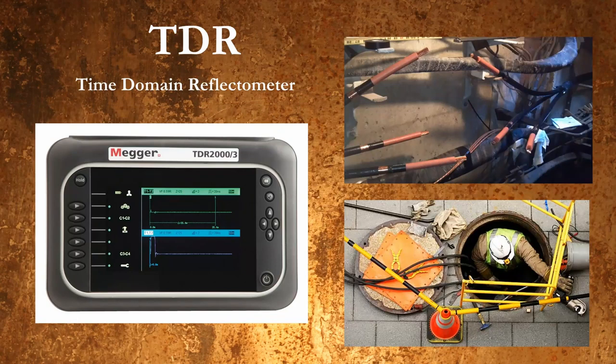Anyone familiar with fiber optic work knows that an optical time domain reflectometer is used to determine the length and condition of a span of fiber optic cable by flashing a light at one end and recording the time and strength of reflections off the far end. Most people don't know you can do the same thing through copper. Instead of light, we use low energy pulses of voltage since copper is obviously opaque — but in practice we get the same information. If you know a few parameters like the speed of light through copper, we can determine the quality of splices and terminations, or the length along the cable to a fault.